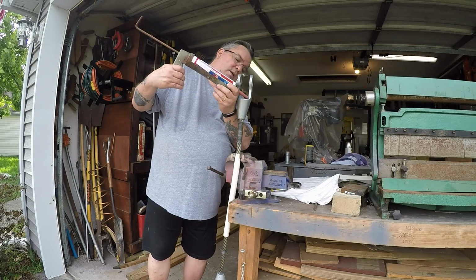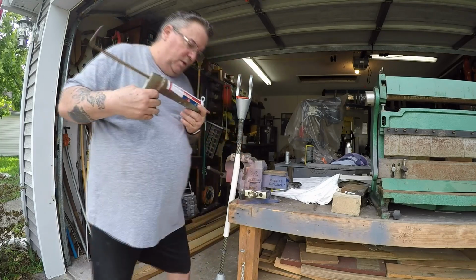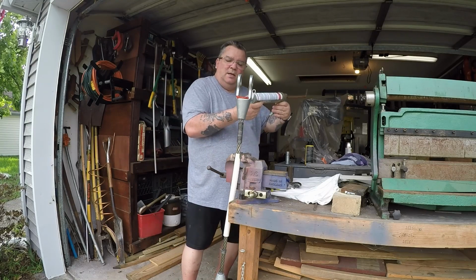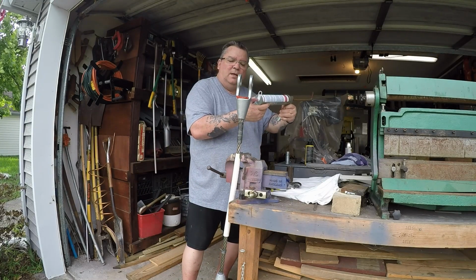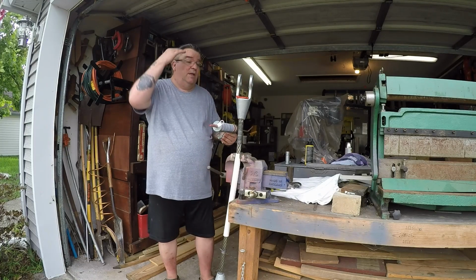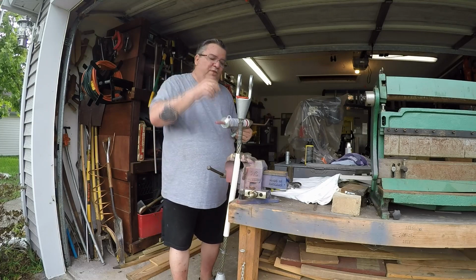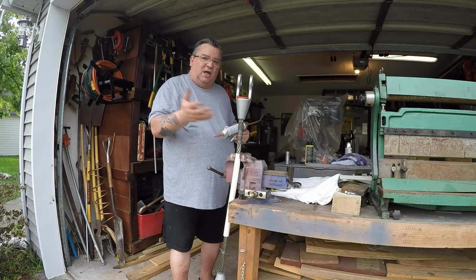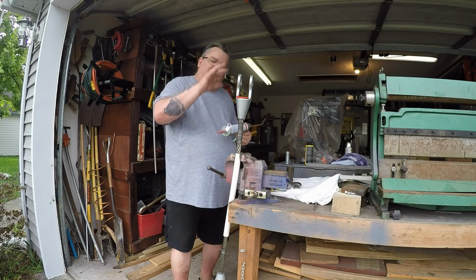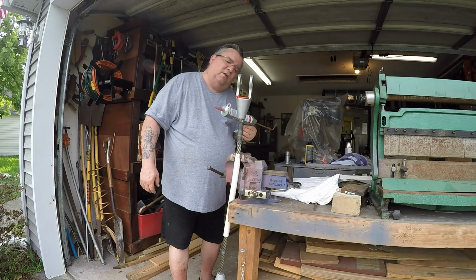So, see if I can do this with some, pardon me. Okay, well, that's a dam. Now, if this stuff is sticky as it's supposed to be, it will stick to that and not be moved by the weight of the molten metal. Now, you want to have a little bit above so that when this solidifies inside here and shrinks down, kind of like the shrinkage in a candle that you pour, you can melt the stuff on top again to fill in that little divot, that little shrink that's going to be around the middle.